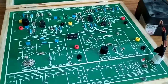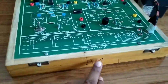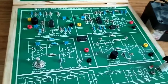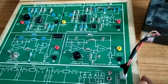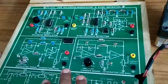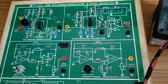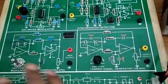This is a balanced modulator, also called a double sideband suppressed carrier modulator. This is one type of AM modulator where we suppress the carrier. Whenever we suppress the carrier at the modulated output, we reduce the wastage of power and increase the efficiency. This is the main advantage of using a balanced modulator.